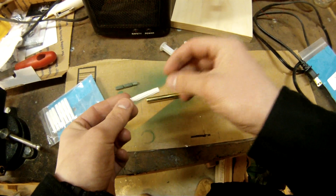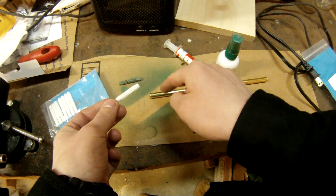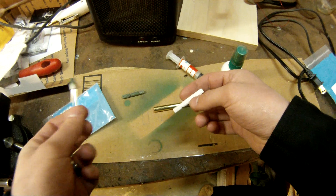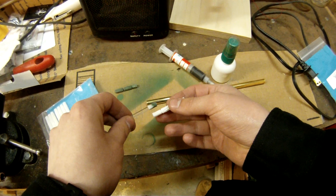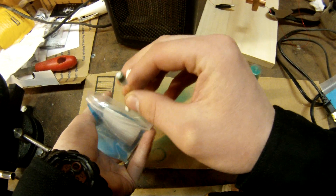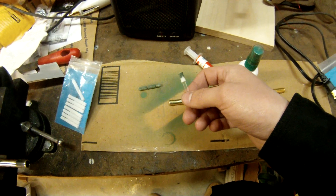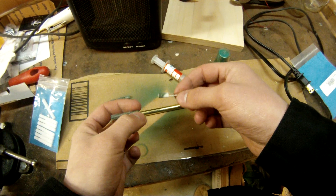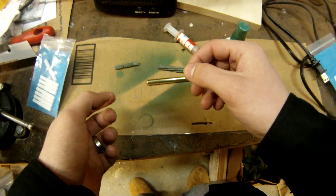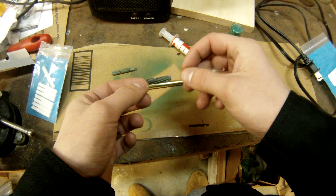You've got to watch what you're doing — this is not idiot proof, I should say that. You can overheat it till you melt this. You can overheat it till you pretty severely burn yourself on the barrel. Or you can over-torque it to the point where you break it. And this is my lubricant lesson for the day, kids. I was working on one of these crowns with this compound, which doesn't contain a nice cutting lubricant, and I over-torqued it and sheared it. So it is recommended that you apply a little bit of lubrication, because otherwise it's going to be a real pain.